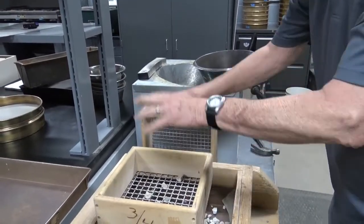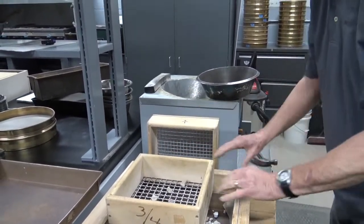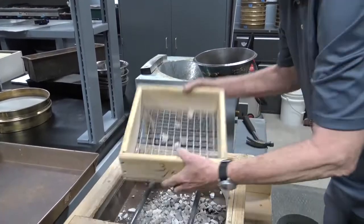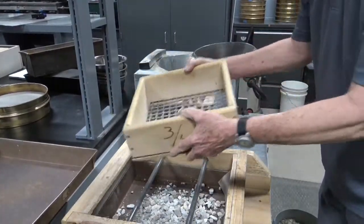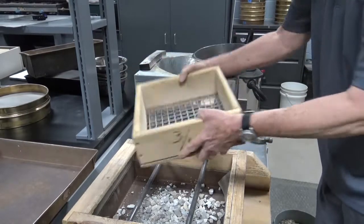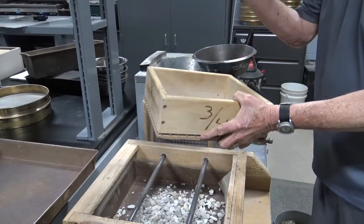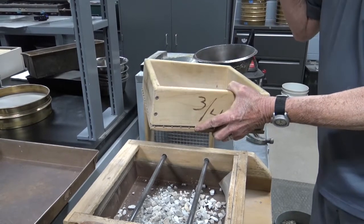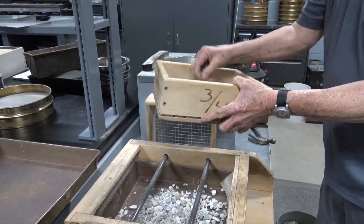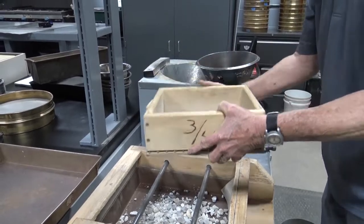when we're going at more drastic speed with these, that may prevent material from falling through. So we also need to slow down, pick the sample up. We are not technically allowed to manipulate the material through the sieve like that. It just has to fall freely.